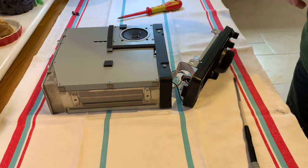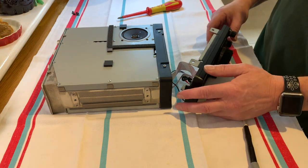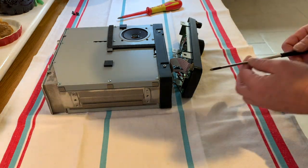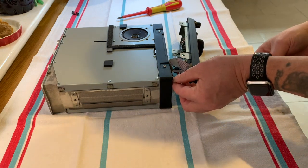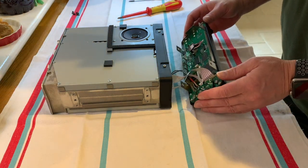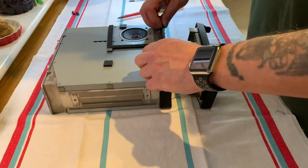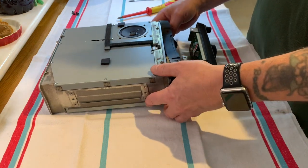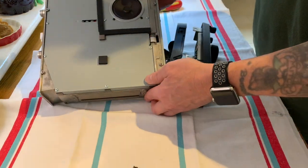Behind the faceplate there's actually another metal plate that has six screws. The earth or ground for the face panel is connected to the top left-hand screw, and that needs to be undone. That will give you a bit of freedom to move the faceplate out of the way, so you can turn the 991 on its side to get to the rest of the screws on the faceplate. You've got to remove the rubber gasket first — be careful when you do this, because it can pull and break the ribbon cable, or even take it out of the socket on the front, so just a little bit of care needed.